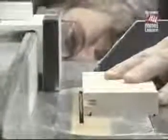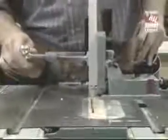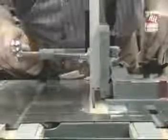Now that's the first of the shoulder cuts to form the tenons. Now I'll make an adjustment, test it, and make the final cuts. With this setup, I've simply nibbled away the material in order to form this haunched tenon. Here, of course, are our cheek cuts done with our tenoning jig.